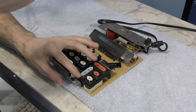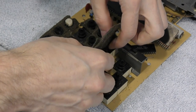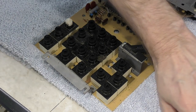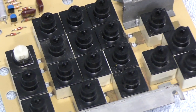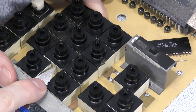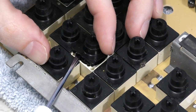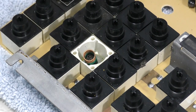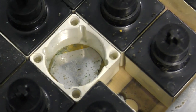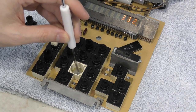One of the problems with these switches is that they are connected to the board using a method that would require damaging them to remove. So my only hope was that I could disassemble the switches from the top. This foam was also on the verge of disintegration, so I removed it — I think its only purpose was to make the buttons a bit quieter when typing, and I could probably create something to replace it if necessary. I'm not sure if I'm going to be able to repair this, but the way I see it, I can't make this thing any worse than it is now, and it's not a particularly expensive calculator as I've seen similar ones on eBay for $25. I started with the number 2 button, because I know for a fact that one is totally dead. With some very careful prying I did manage to pop the top off. Surprisingly, I found a spring inside covered in more of that disintegrated foam. I think they stuck a small piece inside the spring, probably to make it stiffer. And you can see there's a lot of debris left in there from that foam. I wanted to see if I could get any contact from it at all, and with some effort I was able to — so that definitely confirms the switch as the culprit.